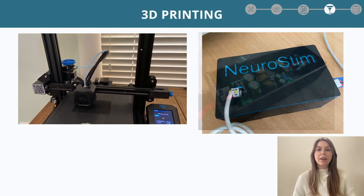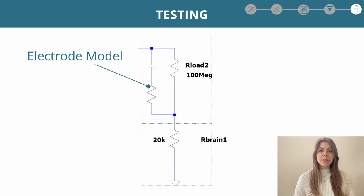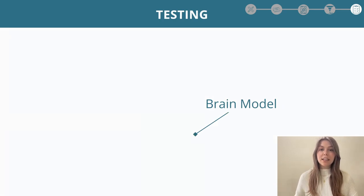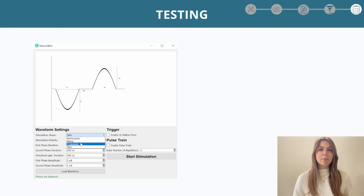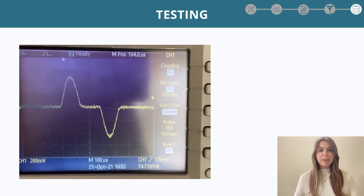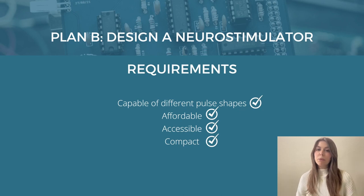Finally it was time to do some testing. I used a simplified electrode model — a resistor in parallel with a capacitor and another resistor — and a simplified brain model consisting of one resistor. I also designed a user interface in Python which connects to the Arduino through the serial port; the user can select the waveform, send it to the Arduino, and the Arduino will pulse the waveform. It can produce a biphasic rectangular wave, a sine wave, a triangular wave, and ramped pulses. It is affordable at only about 150 dollars — compared to over $18,000 for the current lab stimulator — very accessible using basic parts from any electronics retailer, and 92% smaller than the lab stimulator.